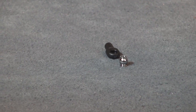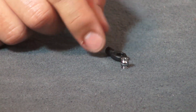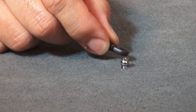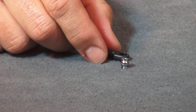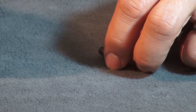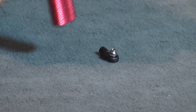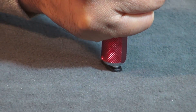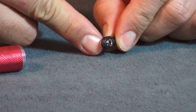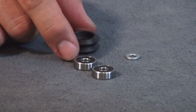We need to assemble the ball joints — it's two pieces: the inner piece and the housing. You're gonna need to do this 12 times; there are two packages with these pieces. You can use either a pair of pliers or a hard surface and the butt end of a tool, placing the ball inside the hole and applying pressure to the top. When you hear it pop, it's in. You should be able to move it freely — that tells you it's good to go.